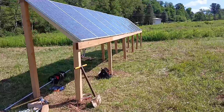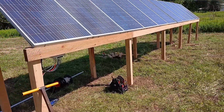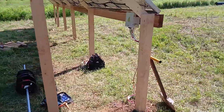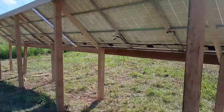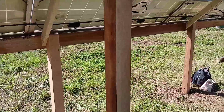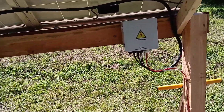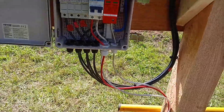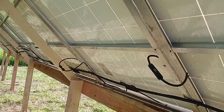This is phase one of our solar project. We got larch wood buried — the Amish are telling me it's going to last a long time. We've got 12 225-watt panels, a little under 3,000 watts, and today we're putting out about 2.3 kilowatts. The guy who zip-tied those wires really knew his stuff. We had a little trouble with some crooked posts because it's six inches of topsoil and many feet of rock underneath. It all comes into our combiner box with a main breaker and 10-amp fuses on each string — three strings of four panels in series.